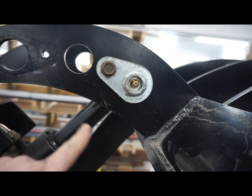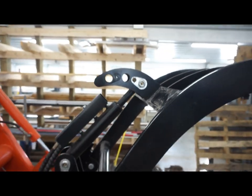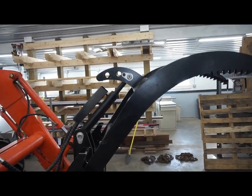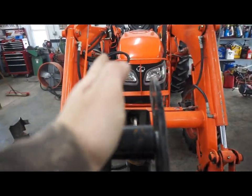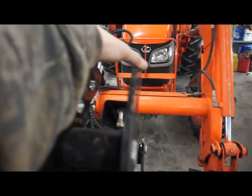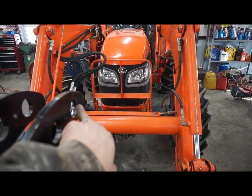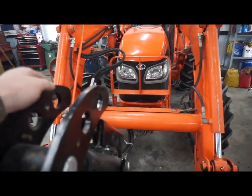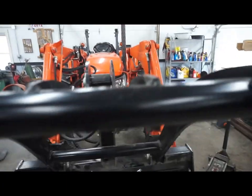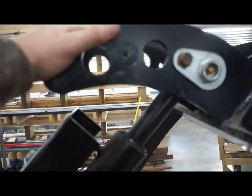this pin that goes through and holds the top link of your cylinder on, when you put it in the other position there, all the way at the top, see if I can get a better view. When they welded this, these almost kind of go out at the top. It must have warped a little bit on them. And that pin, just because it's that much wider at the top there, almost doesn't come out the other side. It does, but it's just kind of closer than what you would want it. They should have either made that pin a little bit longer or done a little bit better job welding that